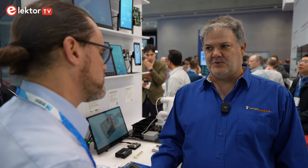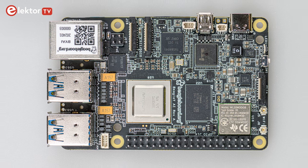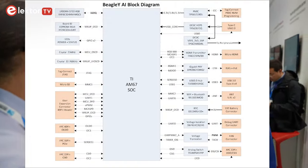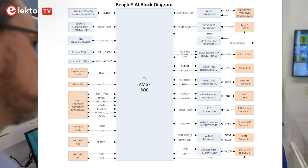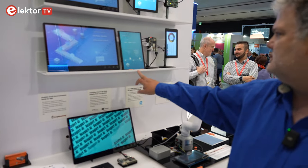In addition to the processor, we need lots of IO and connectivity. What can people find around the edges of the board? So we have four USB 3 host ports, PCI Express Gen 3 over a ribbon cable connection, gigabit ethernet, and a USB client port — so it's power and client, meaning it acts as a USB device as well. There are two four-lane CSI connections, and you can connect up to four cameras on each one. There's also the possibility of three display outputs: HDMI, DSI, and OLDI. OLDI is a really low-cost touchscreen interface — the cheapest way to put an embedded touchscreen on an embedded solution today.